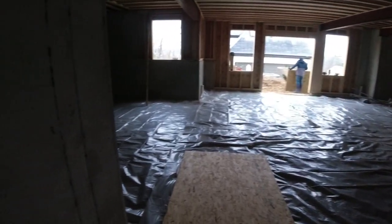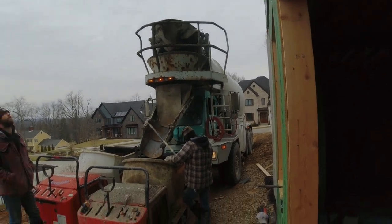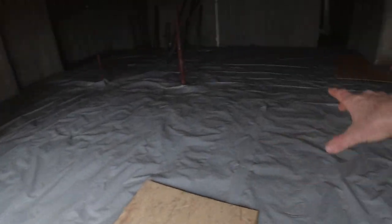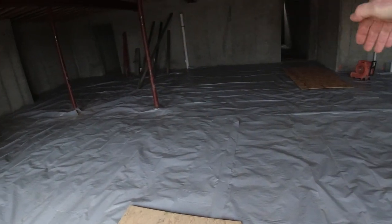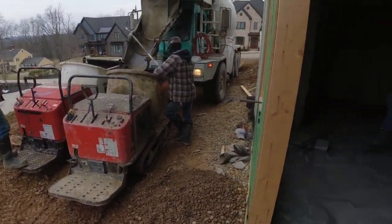This is under the garage area — steel decking and beams. We have a three-foot doorway to come through with our power buggies and pour all this. Nice, easy, flat room, no floor drains. Then later on Monday we'll start prepping the upper deck and get that poured next week. This is the rest of the basement — about 30 yards. Nice Floor Friday. Number one truck at a full mix — two buggies, a quick backup, and right in. It would be a long wheelbarrow push, but since we have the buggies and it's that far, we'll do it that way. I always like to say why we're doing what we're doing. Temperature looks like around 27°F outside, but not too bad inside. Once you get the concrete underground, it'll start making some heat and warm up real nice in here — today we're right around 50 degrees.